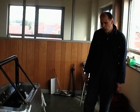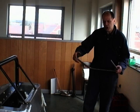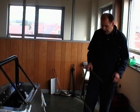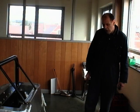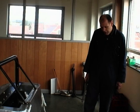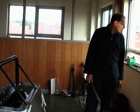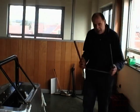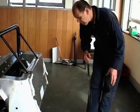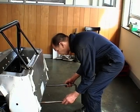Having said that, we've given you in the kit this spare wheel hoop, and one leg is longer than the other. We've trimmed off the other leg to make it equal. And then all we've done with a round file is file out the holes in the rear of the body, which are around about 23, 24, 25mm. And then all we're doing now is getting the spare wheel hoop. You might just have to pull it and push it a bit, but basically we're just spreading it out or pulling it in so it fits the hole.